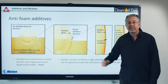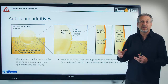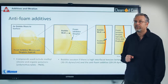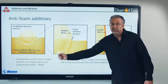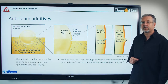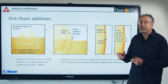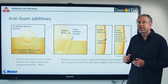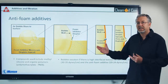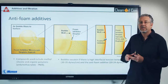If you look at anti-foams or de-foamants, these are actually tiny particles that are designed to cling onto a bubble and puncture it so it will not create foam. They normally consist of silicone chains, PMA, or acrylic. The silicone chains are actually fairly big, up to about 10 micron in size, so they can get sheared and cut in bearings, pumps, etc.